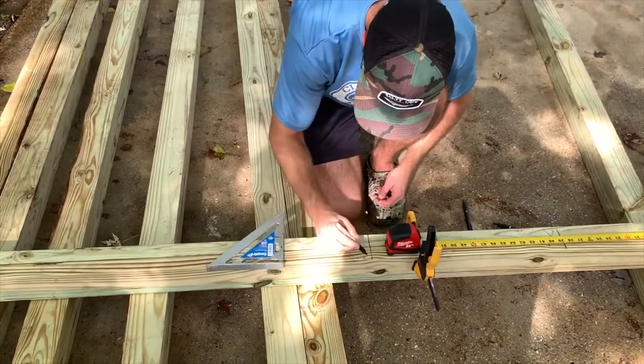So here I am taking my 2 inch by 6 inch lumber and positioning the piece of 1/2 inch plywood in between. There's the full 8 foot long segment and here is the partial segment on the other side. I'm just positioning that in place on top of one piece of the 2 by 6 inch header. And then I'm taking the other 2 inch by 6 inch header and placing it on top. Then I used bar clamps to secure everything while I nailed the header together.